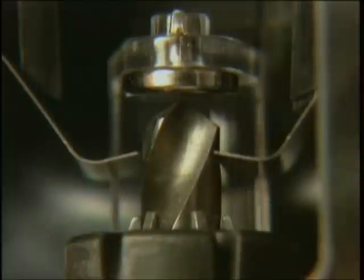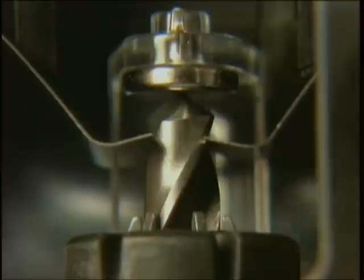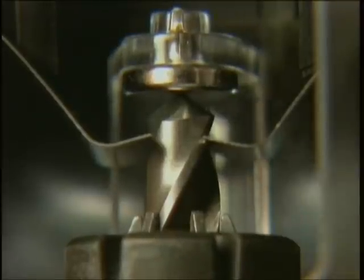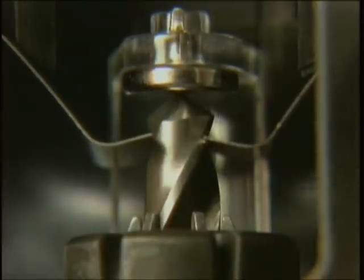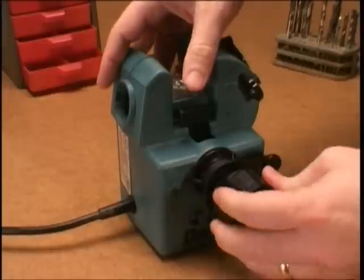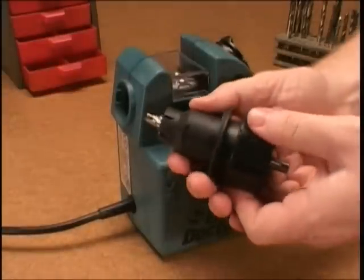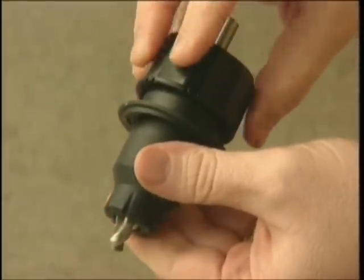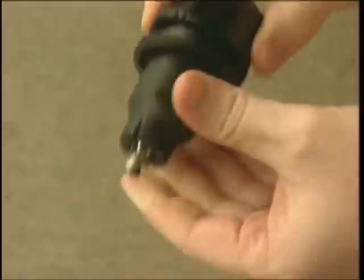Look into your alignment viewer. Make sure the clamp arms are in the bit's narrowest spot. If they aren't, turn the bit to the point that is held by the clamp arms in the narrowest width. This is important because this setting determines the angle at which your bit is sharpened. Then hold on to the chuck and tighten the chuck knob. Press the alignment button and remove the chucked drill bit. Tighten the chuck once more so the bit won't move when you sharpen it.